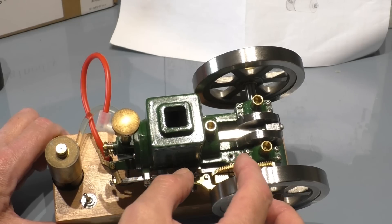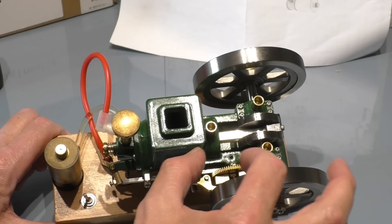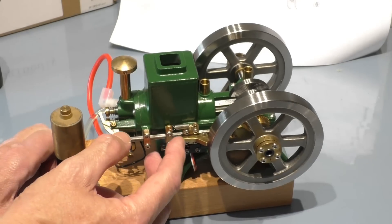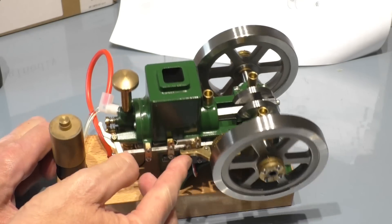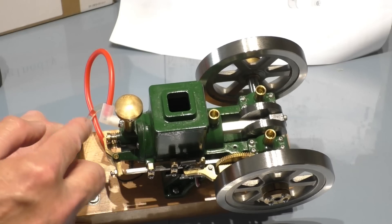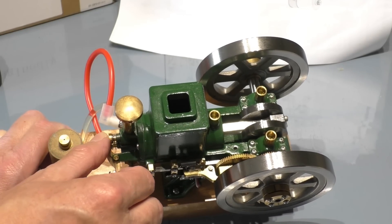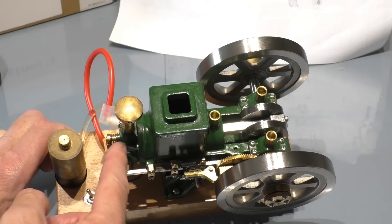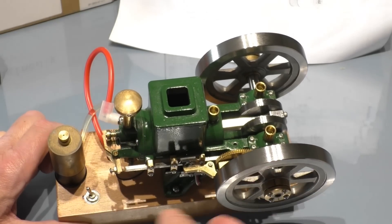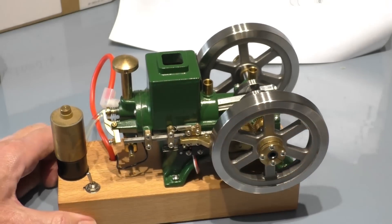The carburettor is at the front of the engine. What's quite unique with these hit-and-miss engines is there's no throttle valve — no butterfly valve in the venturi. Without any restriction to RPM, once started, it would just go faster and faster, sucking in more fuel until it destroyed itself. So it has a regulator: two brass weights on the drive pulley that work by centrifugal force. As RPM increases, they spin out as a governor, and that locks the exhaust valve open, meaning no compression, so the engine doesn't fire.